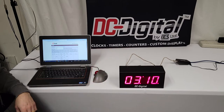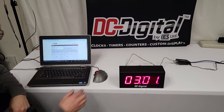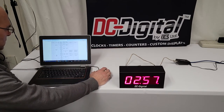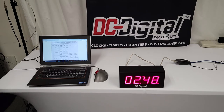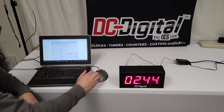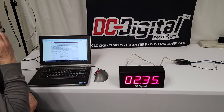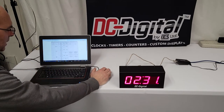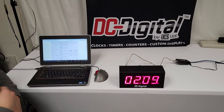This is just for demonstration purposes — you're going to want to set up your software to send these commands. Once you connect to that IP, you can use this command sequence or break it down to figure out what you're going to use it for. It can be used for a time-of-day clock in 12 or 24-hour format, a count-up timer, a count-down timer, or just a static number display. It has a lot of broadcast groups — two bytes that are specific for your addresses, going from A to Z on the first byte and A to Z on the second, giving you a large number of different address combinations.